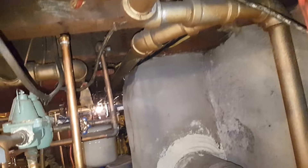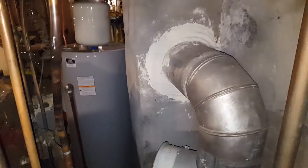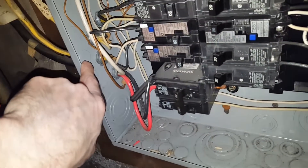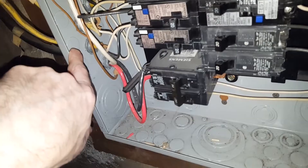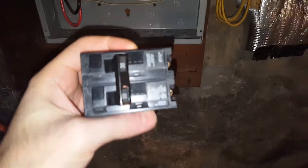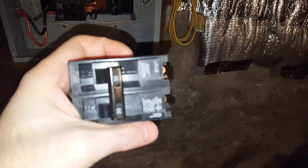I have a 10 gauge cable coming through the studs and the joist for my new water heater. I have just enough length and I'm going to be cutting somewhere along here, then putting a cable connector right here. I'm going to tap out that little circle and have cables go to the ground — and both of these are hot wires, 240 volts.